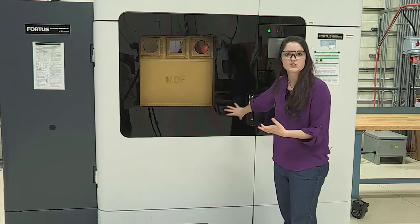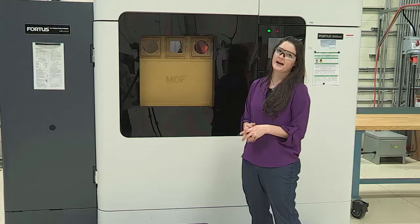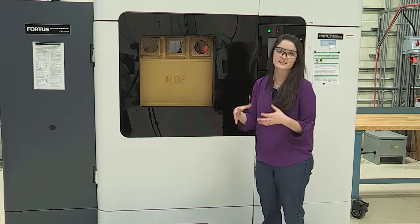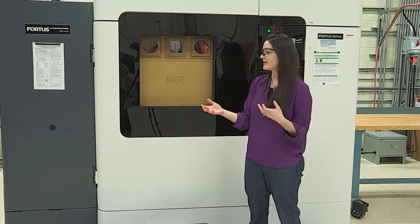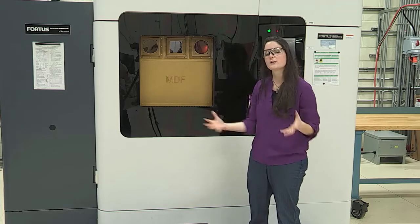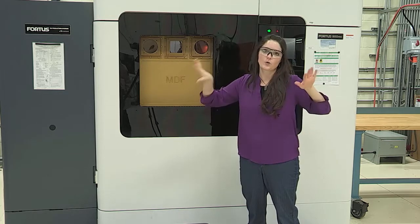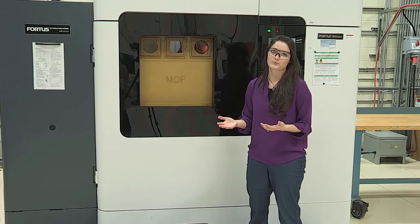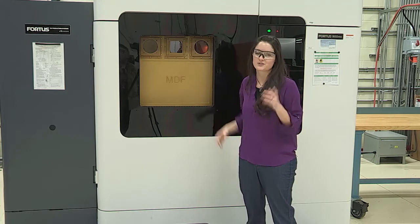Another thing about this machine is that it's actually got a heated build oven. The oven inside here is about 200 degrees Celsius. For the Department of Energy, we've calculated that 95% of the energy of this machine is to heat that build volume. That's because when you're building something layer by layer, the material is cooling and contracting with every layer. And so if you don't have a heated build chamber, you're actually going to get a lot of warpage within the part as it builds layer by layer. On the BAM system, we don't have the luxury of a heated build chamber, so it's actually our materials that make it possible for us to print without a heater.